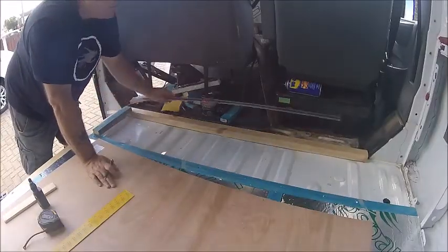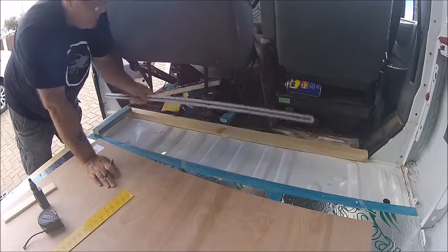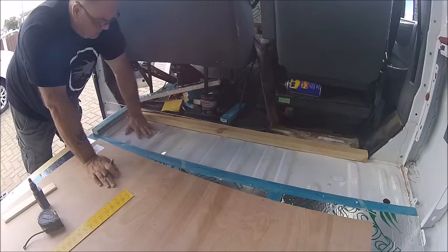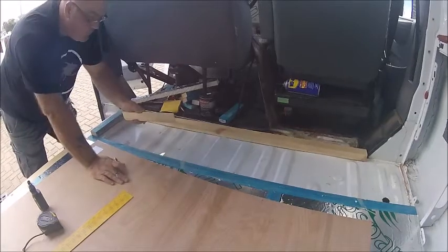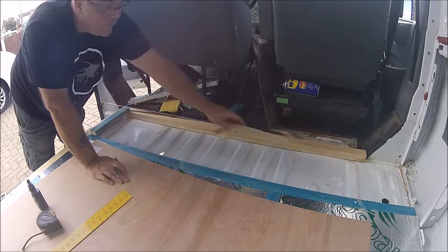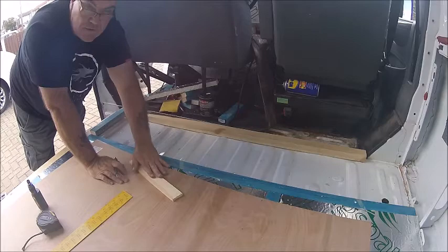Also, if you can see this area here, there's a massive flat area. What I'm doing with those flat areas is to create some rigidity underneath. I've got some ten mil packers — they go into those flat areas. Same as there. So that when the insulation goes on top, it rests on the ridges and on the battens, so it's nice and firm underneath.